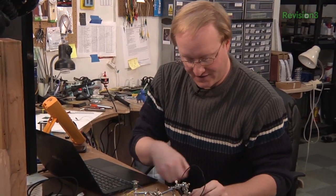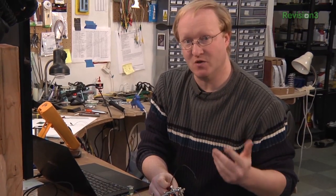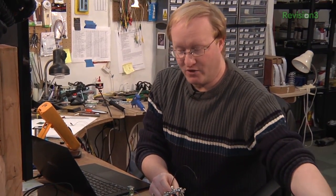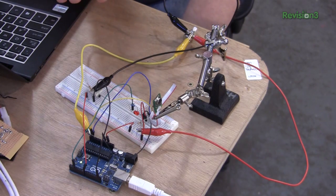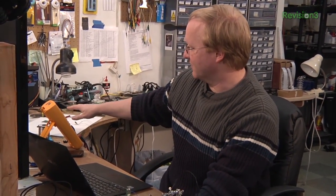I've added a few more things: there's a potentiometer which gives you a range control — basically at which point you'll cross the threshold and trigger it. There's also a piezo with a really annoying beeping pitch. Hopefully that will annoy kids and send them running for the hills. Now that we have this in breadboard form working, we'll miniaturize it and make it into a final result.